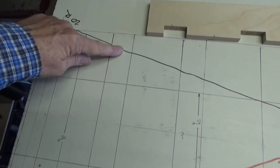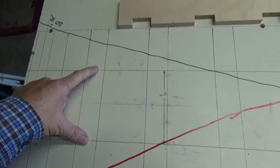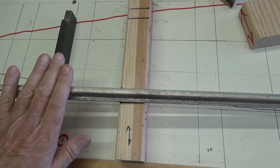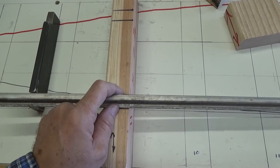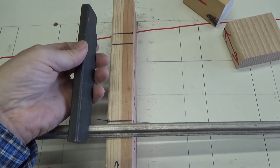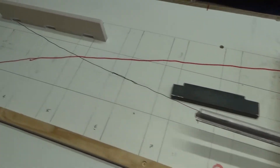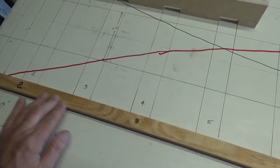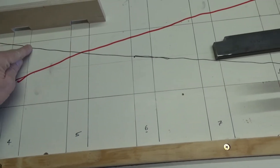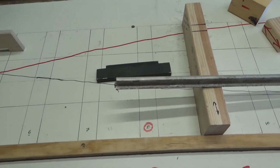You can see here is the pattern for the tie, and here is the five-inch mark. My rails are five-inch gauge. The pattern is: I put all the ties in place, place the first rail, drill and screw this beginning rail in, and then using this steel gauge I place the second rail and screw that one in. The rail fence is easily removable with a few screws, and I've also marked out a couple of typical arcs on here — this black arc is a 20-foot radius and this red one is a 10-foot radius — so I can build curved panels on this as well.